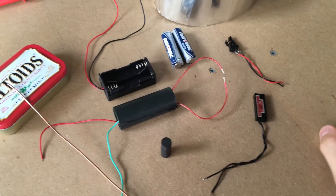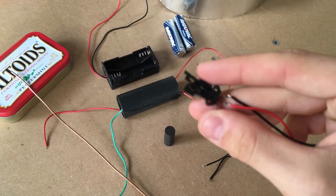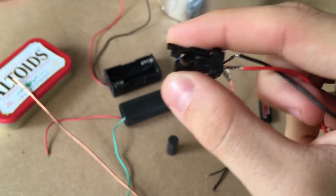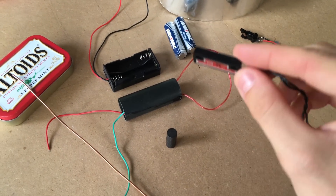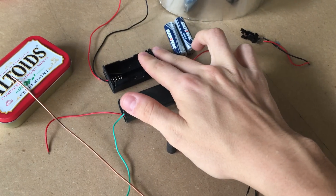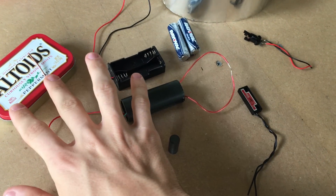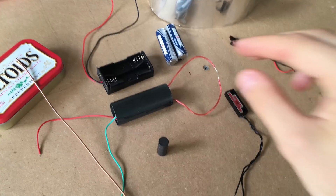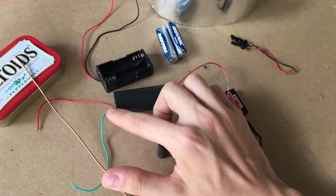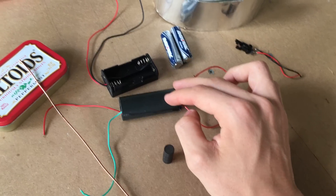For this project, you're going to need some aluminum tape, two AA batteries, a switch — this switch has normally open and normally closed contacts, as you can see when I actuate it. You're going to need a reed relay or a reed switch, a couple magnets, a AA battery holder that fits inside the Altoids tin, a small section of copper wire, the Altoids tin itself, and most importantly, the stun gun module. This takes low DC voltage — like 3 to 6 volts — and steps it up to 400,000 volts DC. A link to this eBay listing is going to be in the description.